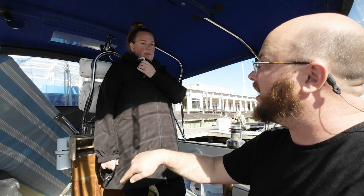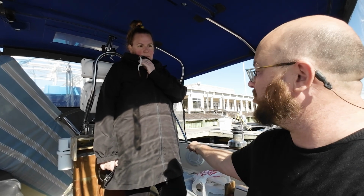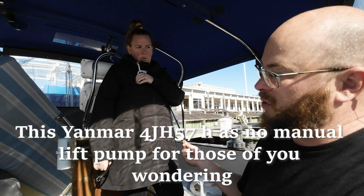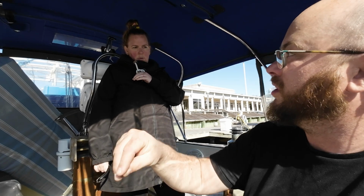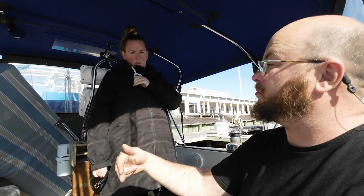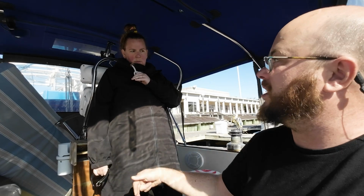Everything on the engine is working fine. I heard it this time. I heard what he was talking about. I heard the electric lift pump this time. When you turn the panel on out here, I heard it go. It was priming the system. Which is the lift pump meant to pull fuel from the tank through everything all the way to the supply pump, the medium pump if you want to call it that. And then that pump is what brings up the pressure to circulate some of it through the system and some of it to the high pressure pump.